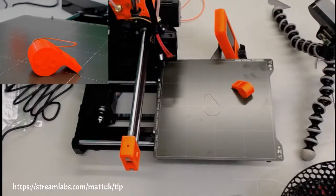Heat break replaced with Bondtech. Extruder replaced. PTFE in hot end was too short. Right, yes, now I have heard that. In fact, Gus was talking about that earlier. I would hope that they have solved that issue. Your extruder will start clicking and you will get hot end blockage. I will put money on it. I have heard people have had that happen, and I have heard people who haven't had that problem.